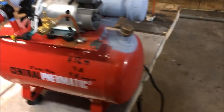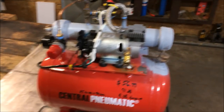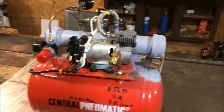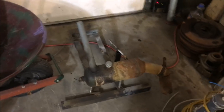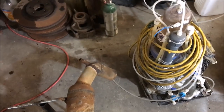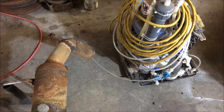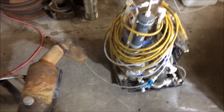Systems using an air blower and an oil pump in tandem are the only systems that can be throttled infinitely from low to high. Siphon nozzles are not easily modulated - I'm finding you can modulate them with air pressure, but adjusting the air-to-fuel ratio is difficult. With a blower-type burner I could turn the oil way down and air way up to get a small, super white-hot flame, or turn both all the way up to shoot 10-foot flames. You can't do that with these atomizer units.